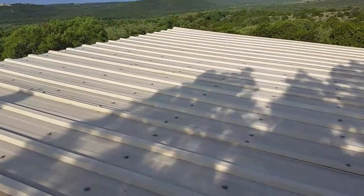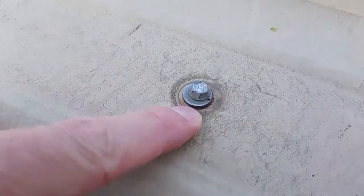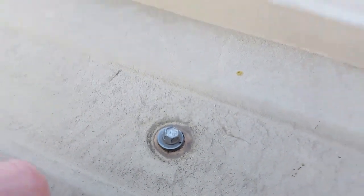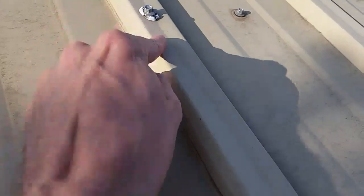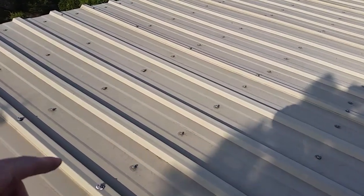The most expensive part of this roof, believe it or not, were the screws. These are little roofing sheet metal screws — they have a little black gasket underneath that keeps water from penetrating into the hole you drill. On each seam you put in this sticky tape underneath; this panel comes over this one underneath. I didn't think it would be waterproof for the years it's been in service, but it really does keep the water out. At first I didn't have the tape and had to undo everything to put it in — that really kept the water out.